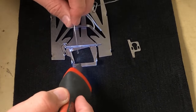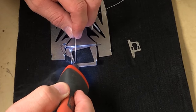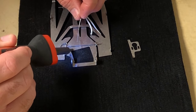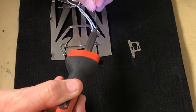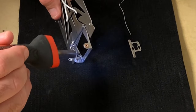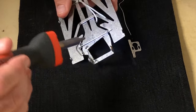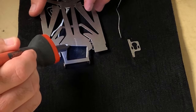And I can tell you from experience that grinding this is absolutely important because otherwise you'll never get solder to stick to it. I don't know if they put a zinc coating or something on it, but solder does not stick well. As you can see, the solder where I ground it, put the acid flux, is flowing out really well. So we'll flip it up and catch the edge of the motor mount right here. It's looking good so far.